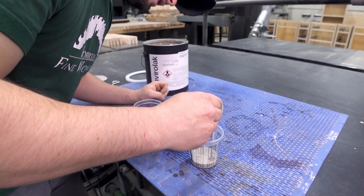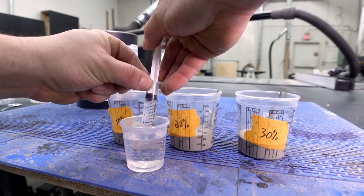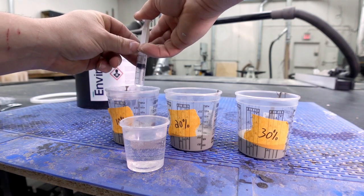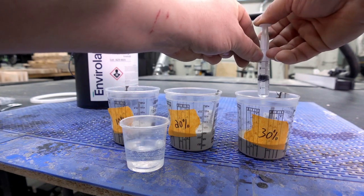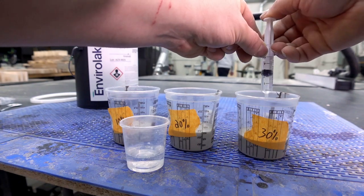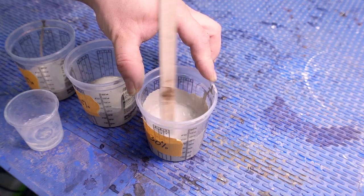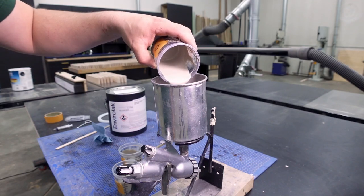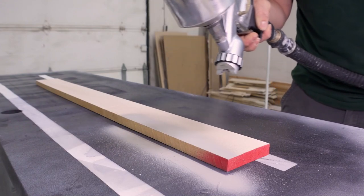We are going to essentially paint everything gray, but not with thick primer first to fill the grain and get a nice smooth finish. Instead, we're going to use the paint as an opaque stain, and we want to be left with physical and visual grain that we can utilize for another coloring step. So I'm diluting samples 10, 20, and 30% to see which one will let the maple grain transfer through, since maple is a very smooth grained wood as it is.